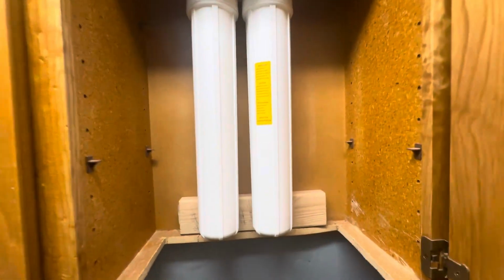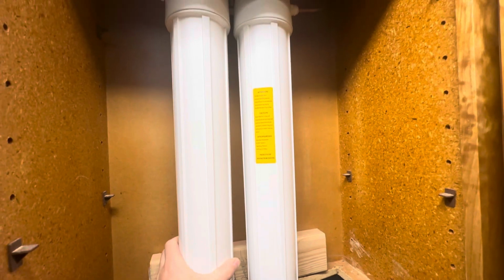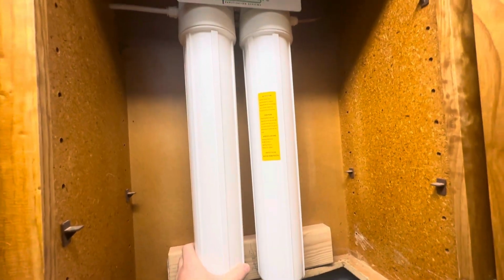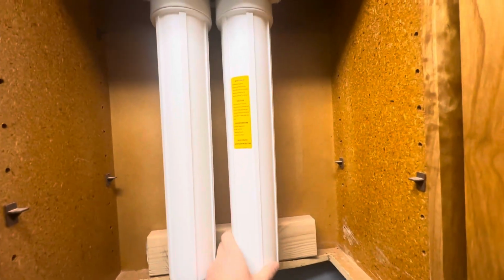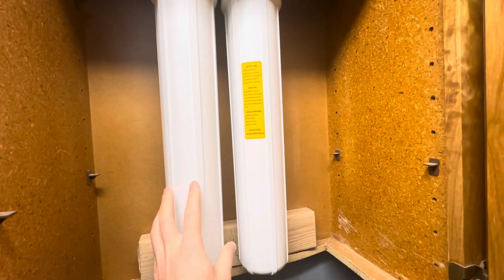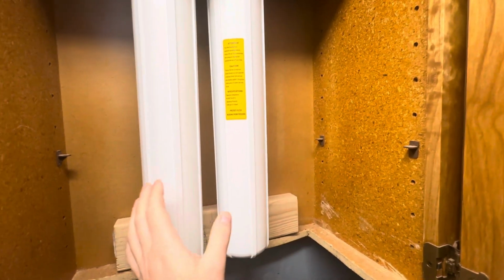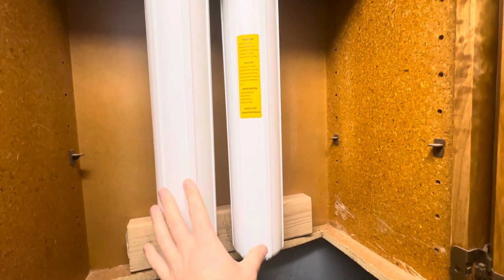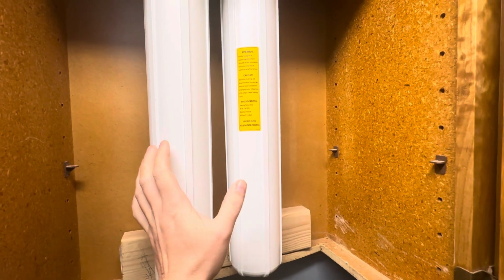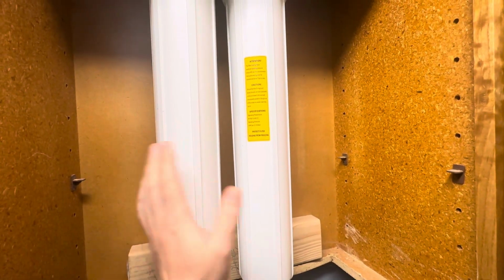And then first off, so these are hydros. You're like, wow, that is a big RO system. Actually, this is just the first stage. So inside these big canisters here are actually two big filters. Now, different microns remove different particles, and obviously the first two, we don't want to remove everything right away because, oh man, the water's flow would be so slow.